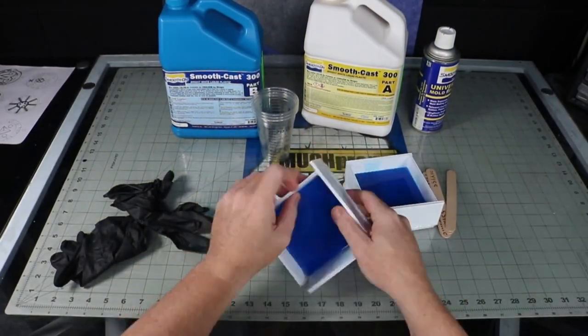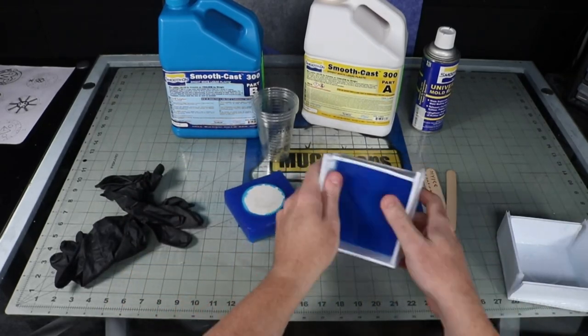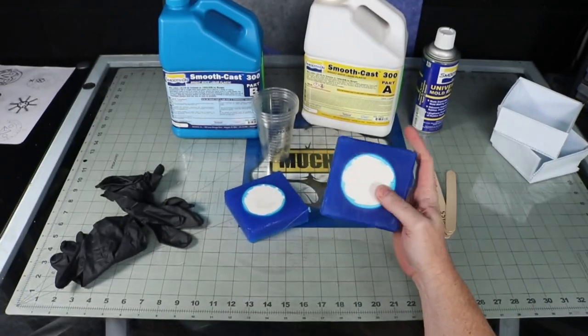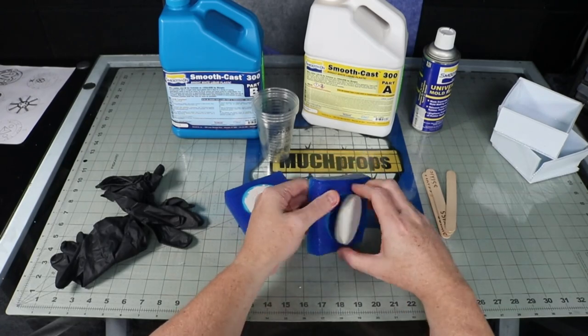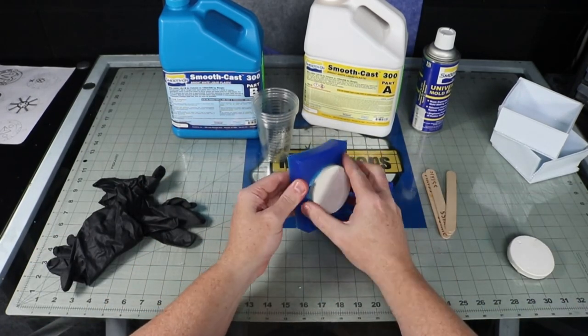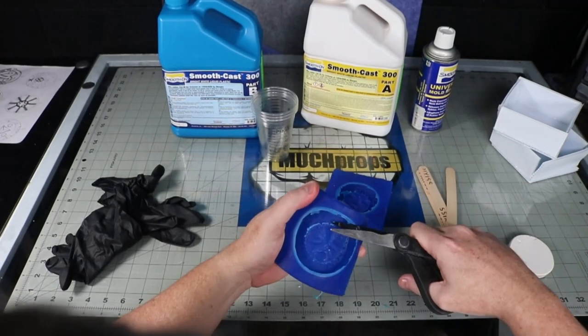After a quick demonstration of my dominance over corrugated plastic and hot glue, I can demold the sculpts. My casting material of choice is SmoothCast 300 for no particular reason other than that's what I'm familiar with. It's a bit expensive, but it's pretty easy to use, sets super quick, and is extremely durable. Just like the molding material, it's equal parts A and B by volume.